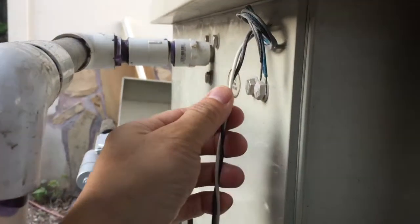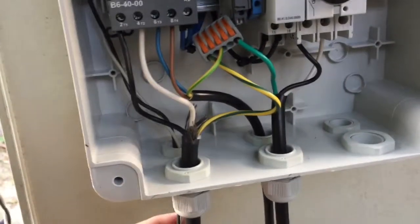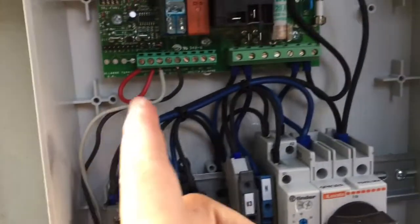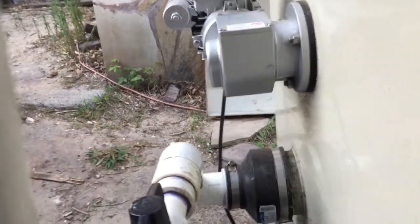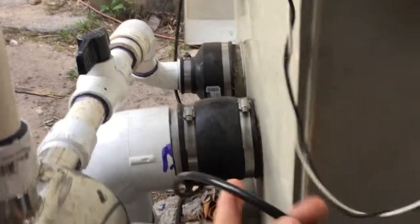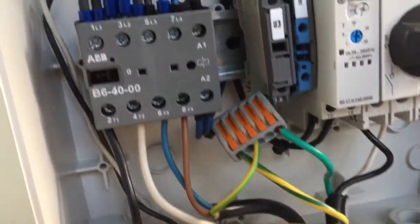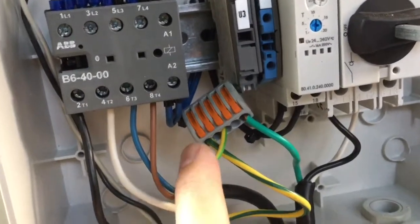I have already connected the wiring to the control unit — let's review it. The two plugs coming out of the casing enter the control unit with the black wire and the white wire, feeding all the way to the top to the third and fifth plugs. The drum has two wires coming out of it: a blue wire, a brown wire, as well as a green/yellow-brown wire.